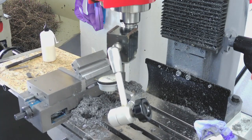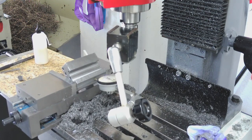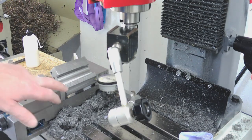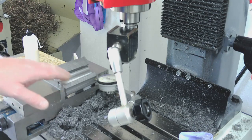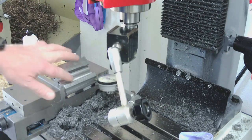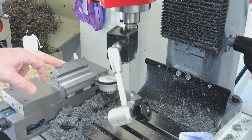I'll just check this now - I'm zero at one end. Oh, this is looking good. Yeah, that's just zero all the way across, and that confirms my theory that on the first side when I was clocking and getting some variance, it was stress relief distortion from machining all the other stuff out.